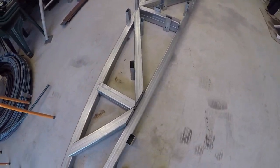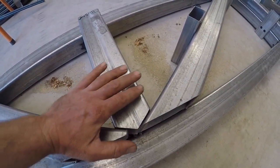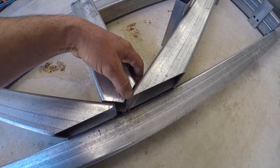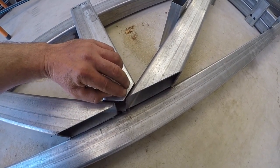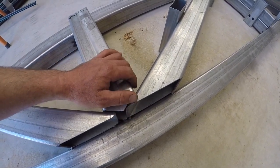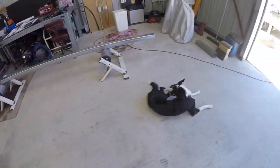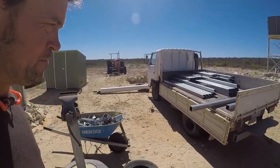What's taken the time is cutting these angles. When it comes to welding, the closer the cut of the angles, the better chance of getting a decent weld. Also, the weld doesn't have to be so big — and if you have a big weld you can end up warping the steel, which we really don't want. We want dead flat trusses.